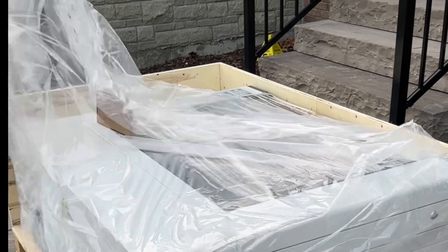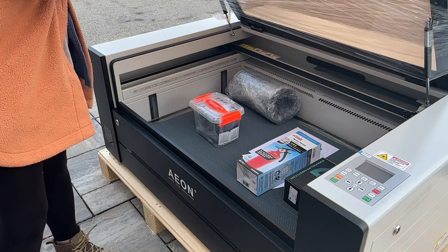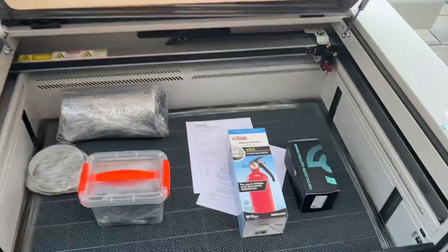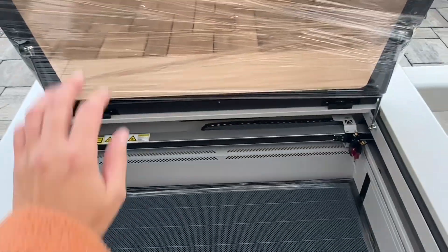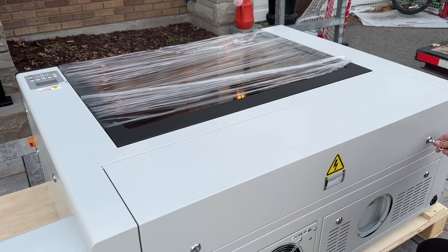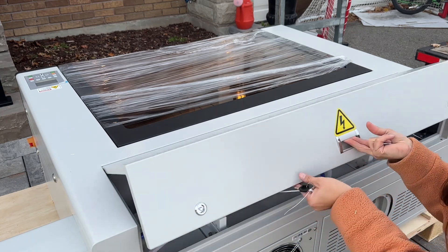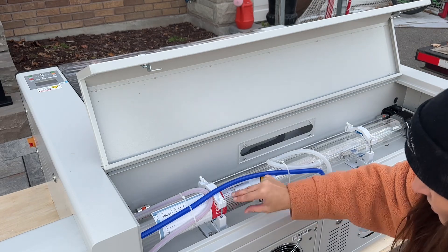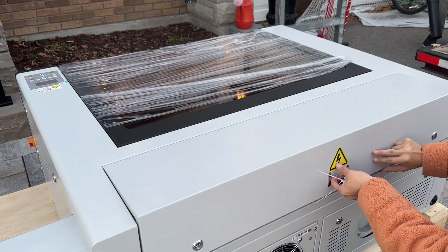I didn't need to worry though — it is packaged so well, I had no chance of hurting it while taking things out. When you open your laser for the first time, you're going to see several things: your tool kit with essential items for operation, your exhaust parts, a fire extinguisher, and your safety glasses. It's very important to zip tie the laser head in place so that it will not be moving when you move the laser, especially if you are turning it on its side. Before you move it, you also want to make sure everything is intact, so here I am opening up the back to check the laser tube to make sure it is in and not broken — it is looking beautiful and solid. You don't have to do anything here; it's already attached perfectly. I'm just making sure nothing has shifted in shipping, and then you lock it back up before you start to move it.